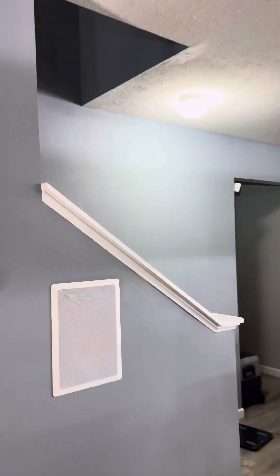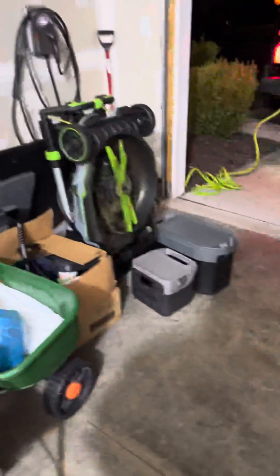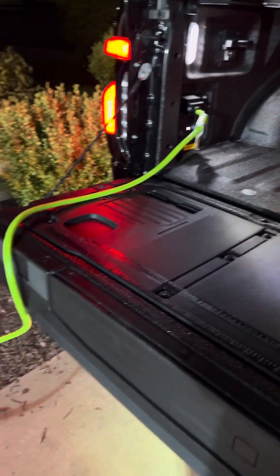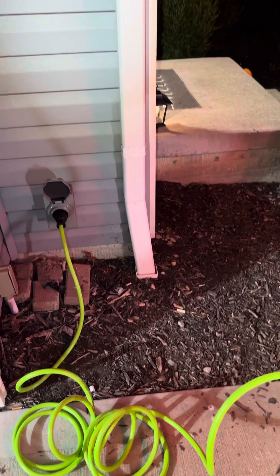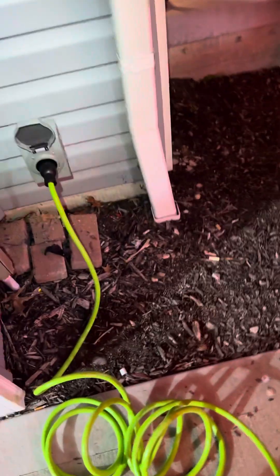Upstairs, bathrooms, hallways, garage — everything is working just from that truck. Just make sure you don't connect the ground wire down into the transfer switch, because it is grounded and neutral-bonded over on the main panel. Thank you very much.